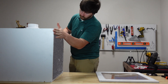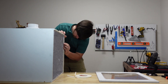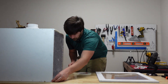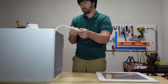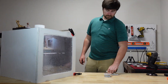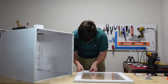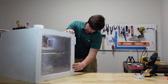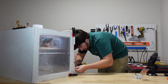I added weather stripping along the outside of the door frame to maintain insulation integrity. I did have trouble getting the insulation to stick, which may be due to the specific insulation I used — glue or door stripping could provide a better seal. To attach the door, I secured it with bar clamps, then marked the hinge hole pattern onto the door itself. I attached some white metal hinges I had on hand, clamped the door back into position on the frame, and used quarter-inch wood screws to attach the hinges so they wouldn't stick through the panels.